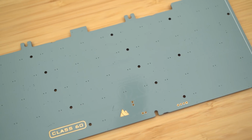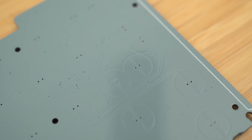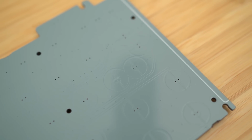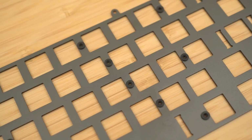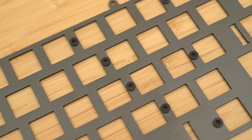So now with that educational bit out of the way, let's take a look at how this works in this keyboard. First of all, the PCB is completely different. It's pretty much bare, it's flat. There are no sockets or anything like that since this is an electrocapacitive PCB. The nice thing is that this PCB is also configurable with Vial. The plate looks similar to a standard MX plate, but you can see that the plate itself has all these little screw sockets and nubs for the screws to catch onto. And you probably noticed that it goes the other way.